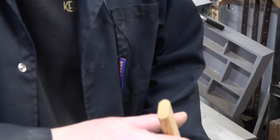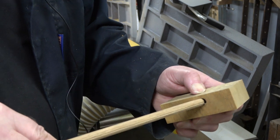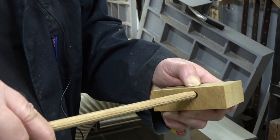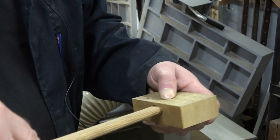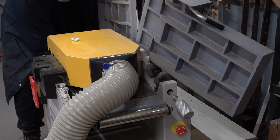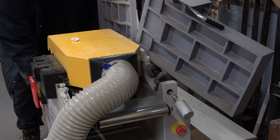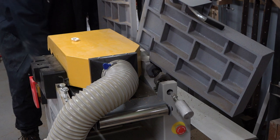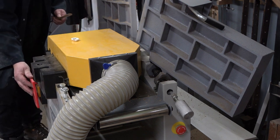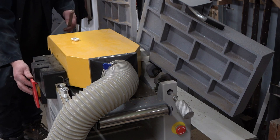I'm going to give it a try at 10.5. It's probably going to be way too big — and as suspected, that is still a little bit snug. We can't get that in yet. We'll put it back through the planer and take it down a tiny bit at a time. So we're at 10.5, I'm going to take it to 10.3, take it through one side, then take it down to 10.1, flip it over, take it through the other side, and we'll see where we are from there.